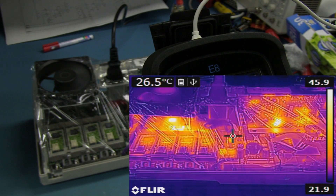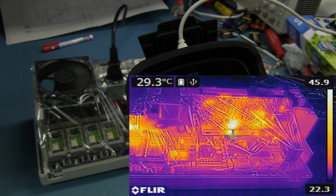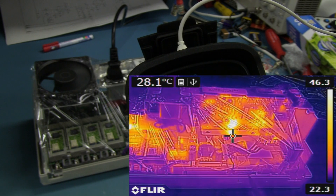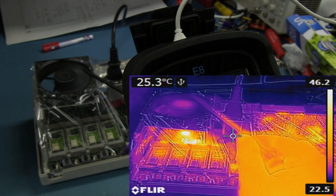That is really quite neat. We can leave it running, and it shouldn't shut down like it does without the case — because the cling wrap is effectively acting as a case with that airflow. The cling wrap has some loss and isn't perfect, but it allows you to see the thermal profile without distortion. Most crucially, it does get that airflow happening, which is what you want when testing your real product. You can even see the motor in the centre of the fan heating up.